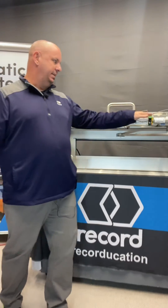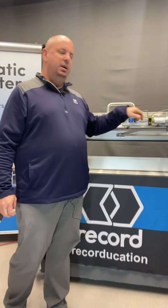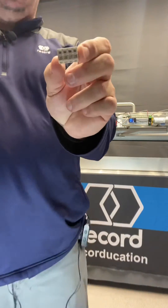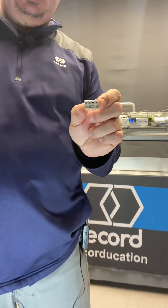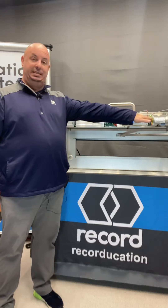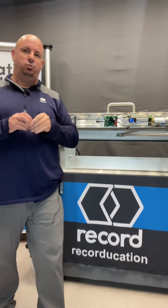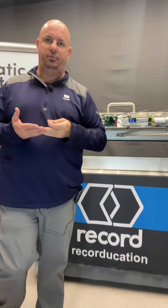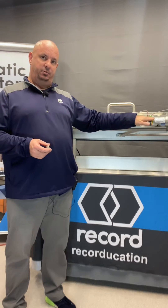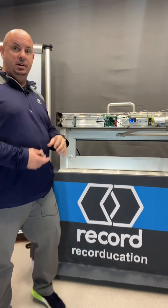we need to install a sync cable from 25, 26, and 28. It's going to go on your sync plug. We've had some instances lately where folks have tied in the 27 to 27, and 27 is your power for your BDE or your display pad. So when you put 27 from this control over to 27 on your slave control, things don't work very well.